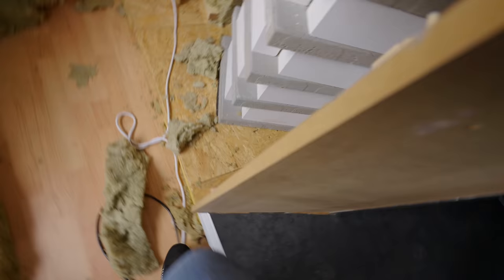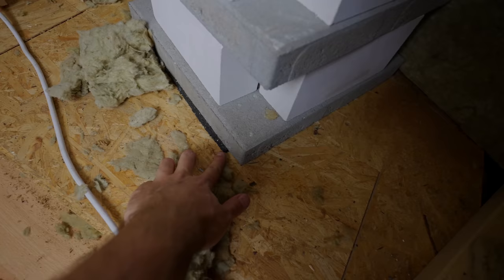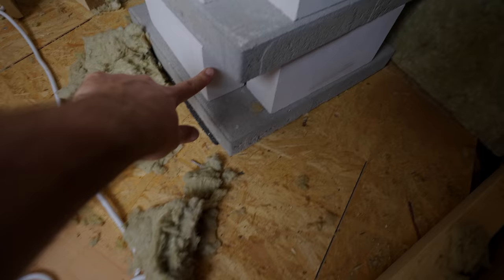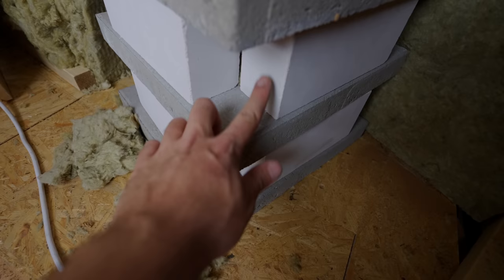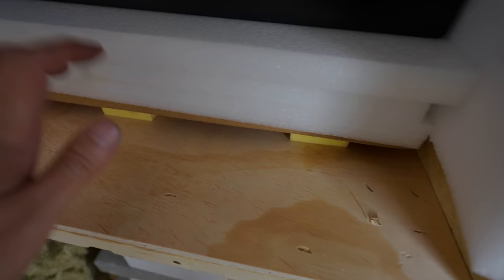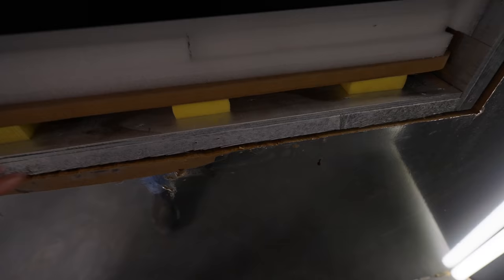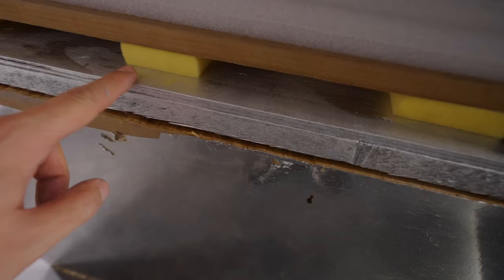It all starts here on the back wall: we've got rubber, then concrete, a different kind of concrete, another different kind of concrete, and in between a spring — same again here, the spring in between. The spring also has rock wool in there, then again concrete, concrete, spring, concrete, spring. Three times concrete on top to make it extra heavy, then a box and a layer of wood — you can actually see it from the front. We painted it silver just for now to match it a little.